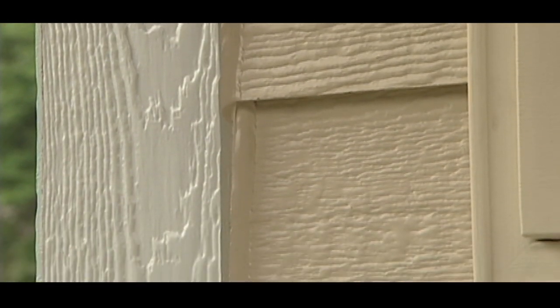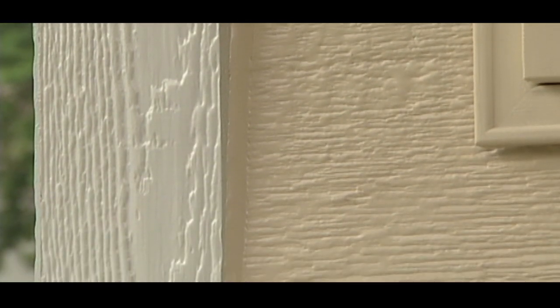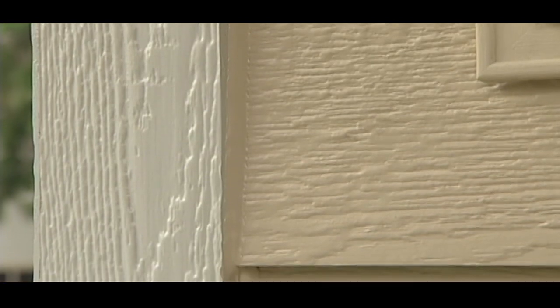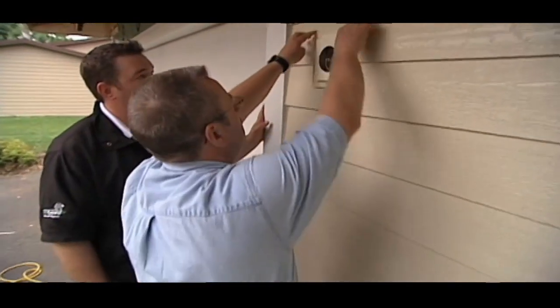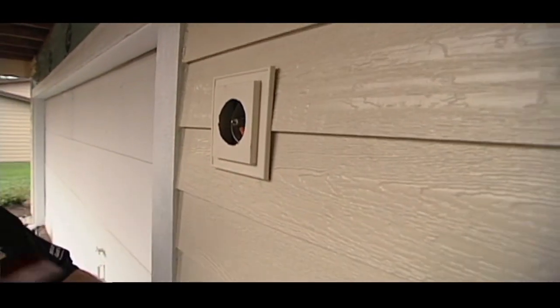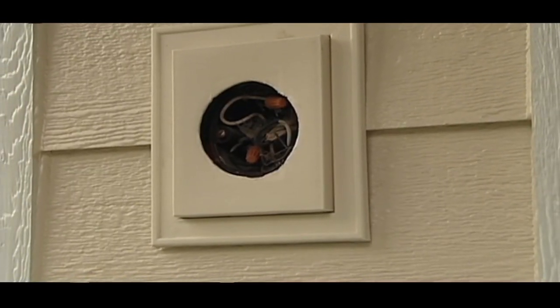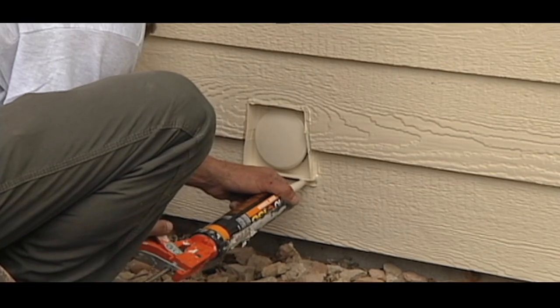This is something that we train on a regular basis — it's one of the detailed things that can really look bad if you don't know what you're doing. The last thing you want to see is bubbles in the caulking. Another area is around the different penetrations in the siding itself. We've got custom light blocks, custom electrical blocks, custom blocks that go over plumbing fixtures and dryer vents. These are things that finish off your house, and if you're not using the proper materials or techniques, they're really going to stand out and make a good siding job look bad.